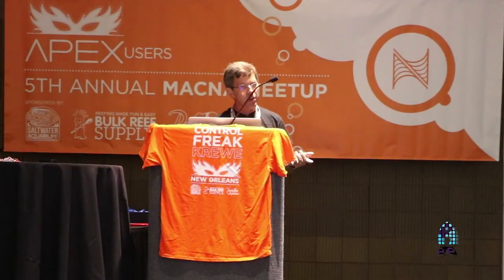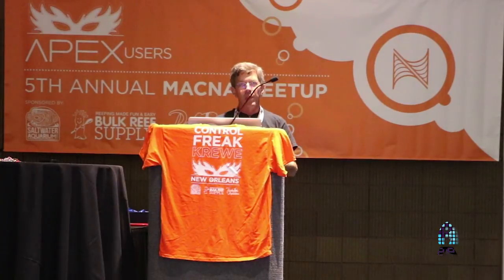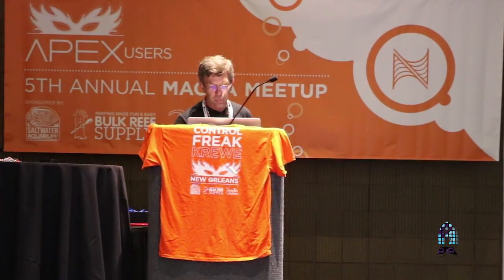All of these other devices, as far as I'm aware, are using multiple different pumps, one for the sample and one for the reagent. And there are just issues there, where as the pumps wear and as the tubing wears, the rate of delivery of the liquid is going to change slightly. And the whole thing that you're doing in a titration is you're getting the ratio of sample to reagent, and that ratio is what determines your result. And so with a single pump, even though there will be some wear and some change in flow of the fluids over time, it will equally affect both the sample and the reagent, so that this ratio stays the same, even though the actual flow rate is different.